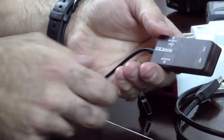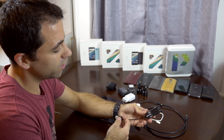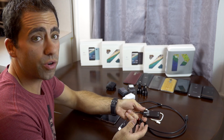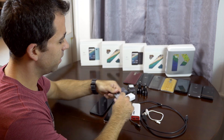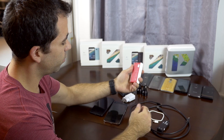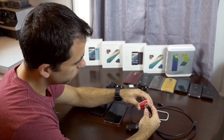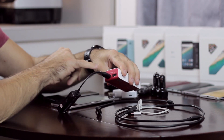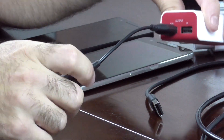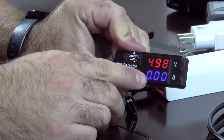Right here I have my little trusty tool — this is a USB voltmeter and amp meter. I've used this to go through some testing about which chargers actually charge these things regularly or even rapidly. I have just a little quick charging brick here. We can try this one out to get a baseline. It has a 2.5 amp and a 1 amp output. We'll use the 2.5 for now. You can see it's putting out close to 5 volts, 0 amps because we have no load on it currently.